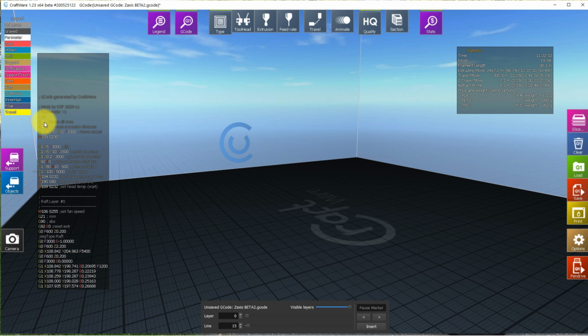And you can see, you remember my script I put into our G-codes. That's how I can see here. We home all axes, reset extrusion distance, we move the nozzle, and we set the nozzle temperature to 230. That's because this information is not coming from the G-code we made. This is coming from the printer setup and implemented into the G-code. So it lifts the nozzle, it moves and gets ready to prime.